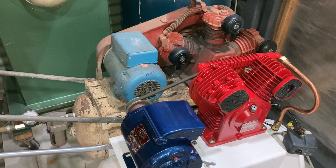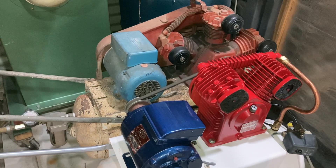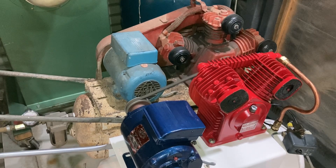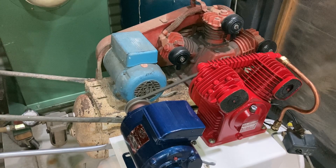So why the change from my original plan to just run two pumps? It was an evolution rather than a sudden change of heart. To run the second pump on one compressor would have meant a much bigger motor that I probably couldn't have run on 240-volt power — it probably would have needed to be three-phase, which I don't have. This also proved more versatile: I run the rest of my workshop including my powder coating off the small compressor only — I don't need to run the big one, which is a lot more economical power-wise. Cost was a factor too — this compressor cost me almost nothing to recondition except for a can of red paint, whereas buying a bigger motor to run two pumps would have been quite expensive. And my last, perhaps a bit morbid, reason: if something happens to me, nobody's going to want to buy some backyard homemade compressor, whereas this way I've got two good compressors that can be sold.